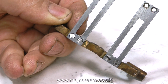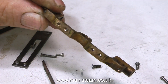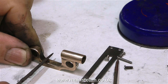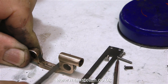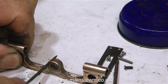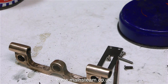When the stainless steel bolts are fully tightened, the crosshead guide is at 90 degrees to the motion bracket. And on the subject of motion brackets — look at this one. This is the motion bracket for the engine and I'm just going to clean it up a little bit because it's a bit rough around the edges. I'll use a needle file and some sandpaper, then the polishing spindle, and then maybe some more sandpaper. But finally I'm going to finish it off with Scotch-Brite because I do not want a highly polished finish on this component.